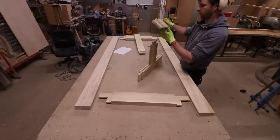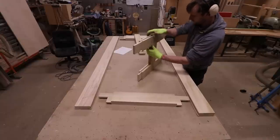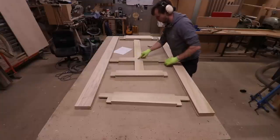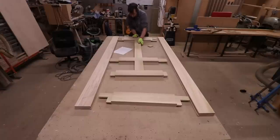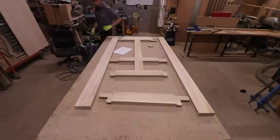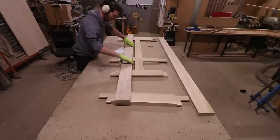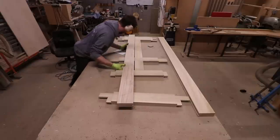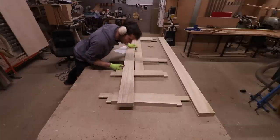There's a top mark on this somewhere. Making sure you've got all face marks on the same side. And if you want to, once them muntins are all in the rails together, we can sit the style on and just use our marking out tick lines as a reference to make sure that nothing is vastly out. So they want to be pretty much spot on with our setting out lines.